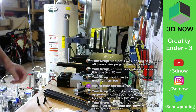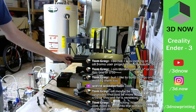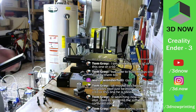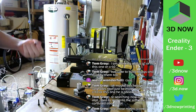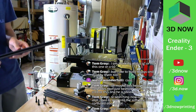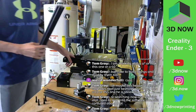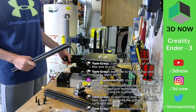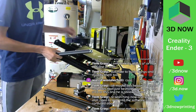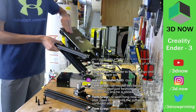Yeah, so software side, you get a 3D model in STL format or OBJ. Those are metric screws, probably. So you get it in STL or OBJ format, usually STL, and then you insert that STL into a slicer. So Cura is what I like, also Simplify 3D, but that's $150. Cura is free. It's from Ultimaker. And then you insert that into a slicer.